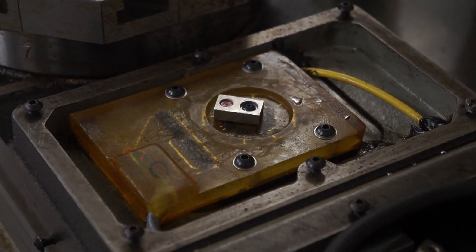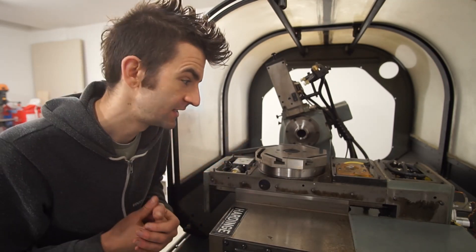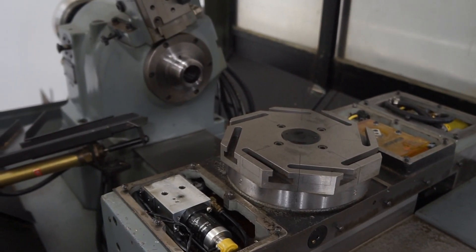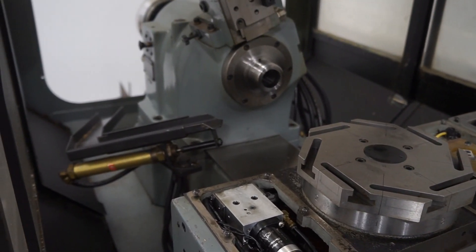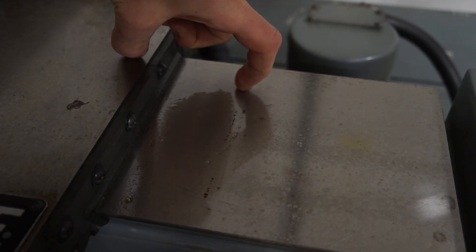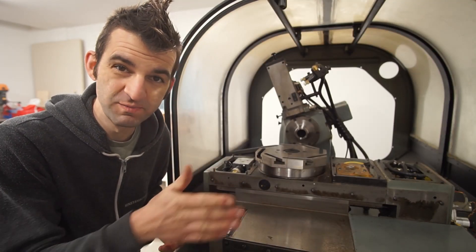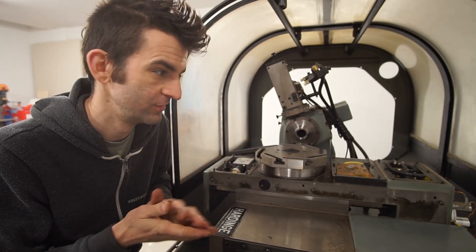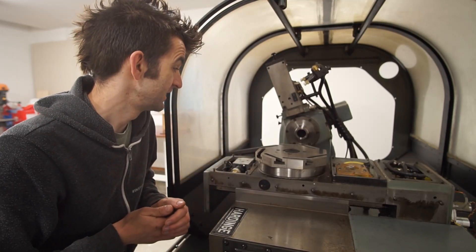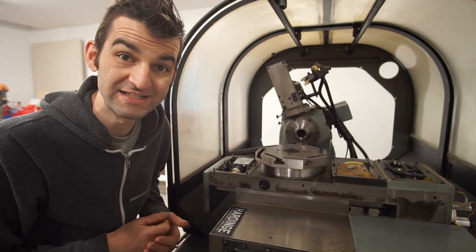We're going to get rid of most of that because we're going to put modern servos on it. I don't need all that information to drive just a DC motor because that's integrated nowadays. I moved the carriage around, got everything checked out, basically looking for rust spots and nicks on the bed. The bed is immaculate — there's really no problems. There's a super minor bit of surface rust from where the way wiper was sitting, the one spot it pushed oil away. The nice thing about a machine bathed in oil is there's really no point checking for rust. It was actually nice that it was put away with oil on it, basically left in its running state because it protected it.